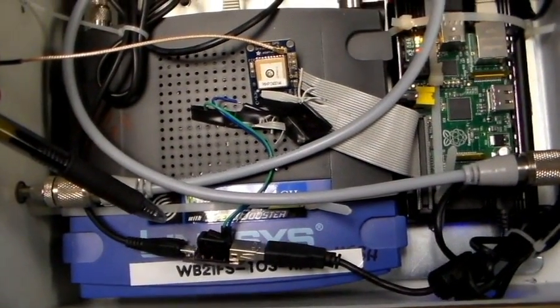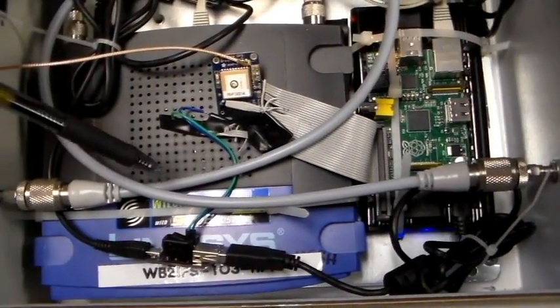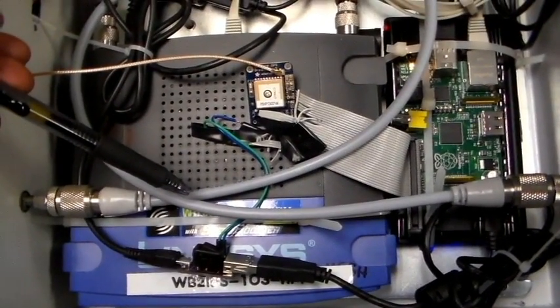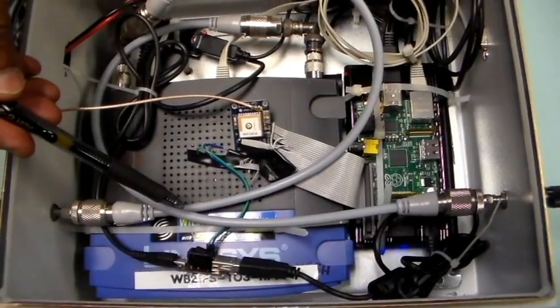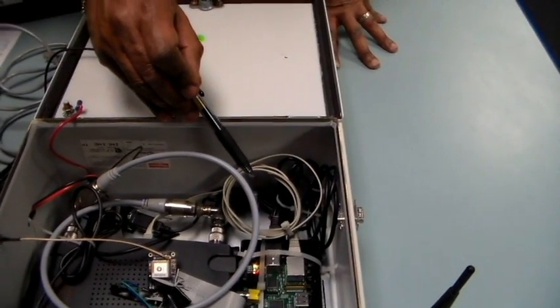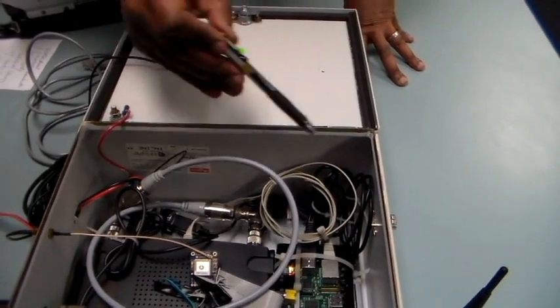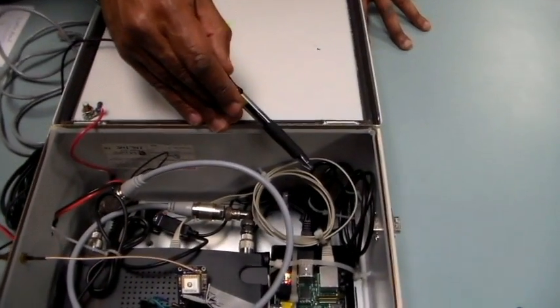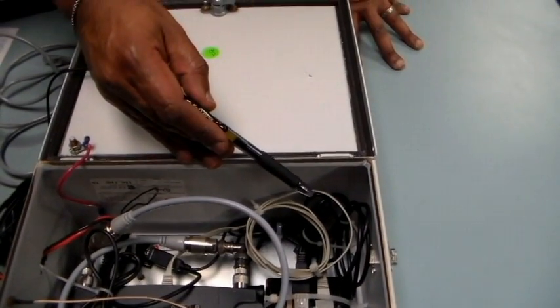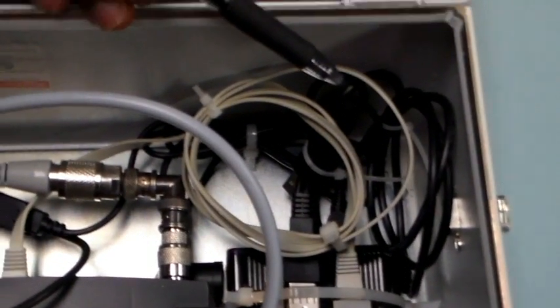This little thing is really handy — it's a switch. Normally, to shut down this system you'd have to log in and type in your password and tell it to shut down. With this switch, all I have to do is flip it and it sends commands to the system and shuts it down, so I don't necessarily have to be connected to the computer. This is serving up a couple websites right now: a GPS page that shows the satellites that the radio sees, and a situational awareness page for hams involved in a shelter or incident, which even includes a little chat routine.